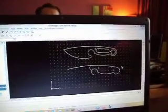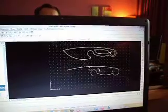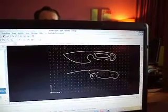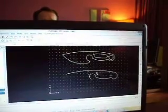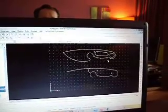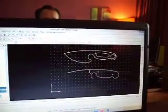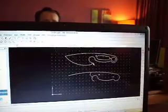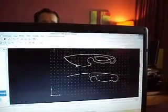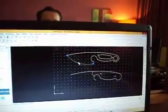But really that won't matter so much for the water jet, but once I get the blank cut out of metal, I can put up a piece of micarta and it will come in here and cut the holes, and then it would start in here and cut this out and then part it off right there, so that I would have a perfectly fit, already drilled handle scale ready to either rivet on or use another kind of fastener, whatever I wanted to use, to attach that straight to the knife, and it would already be profiled, so then it would be just a small amount of finish sanding to clean up the edges, and then do a cutting bevel over here. So of course you'd do all that work before you put the handle on, obviously. And then you can check out your knife.